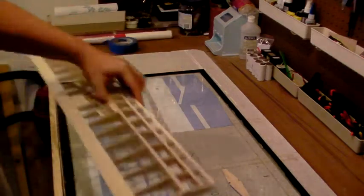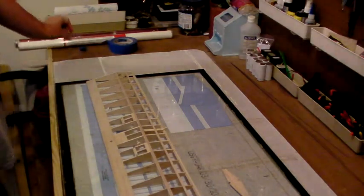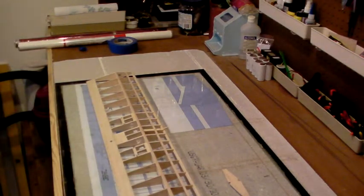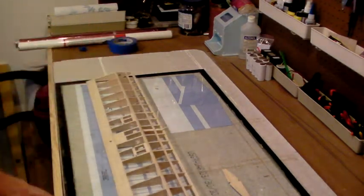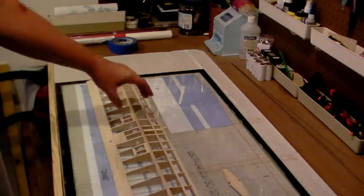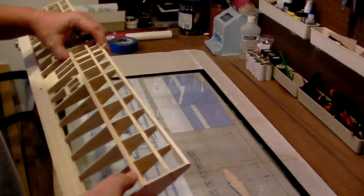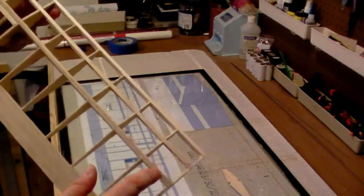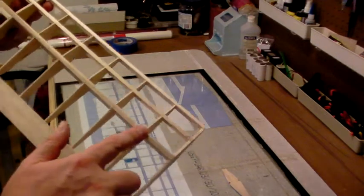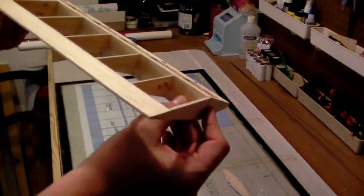This wing is finished — I finished the build and then didn't start the camera. So this wing you're looking at is done, but from where we left off in our last video there are a few things to go over. First off, we've glued in shear webbing. Shear webbing is a neat way of adding a lot of strength without adding a lot of weight, on the backside of this second set of spars right at the peak of our airfoil.